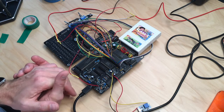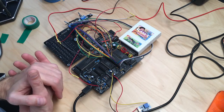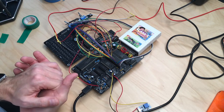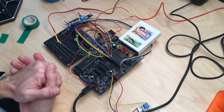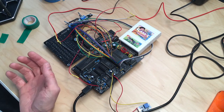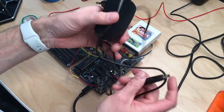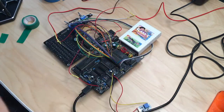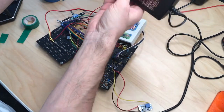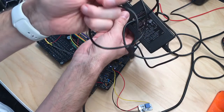So this morning I woke up and I thought, hey, this snowy picture looks a lot like interference, and interference often comes from some voltage related issues. So just for fun, I took this power supply, which I used for all my testing, and I replaced it with this power supply, which is, I guess, a laptop power supply or something like this. Much better. Had to fiddle on a matching connector,